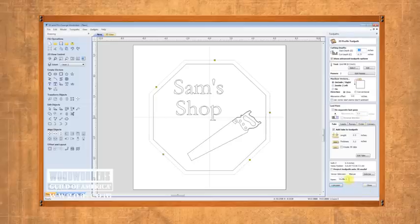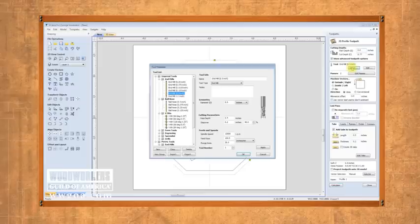Close. Now let's choose our cutter. We're going to do this with a 3/8 bit. And there's some economy of movement. Remember, we're doing our clearance on the inside with a 3/8 cutter. So if we use a 3/8 bit for this, it saves us a bit change.